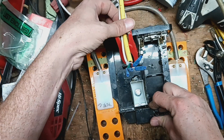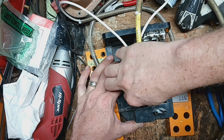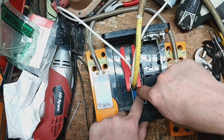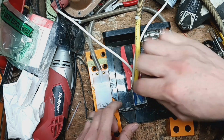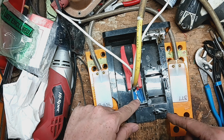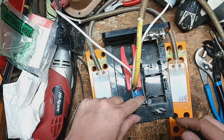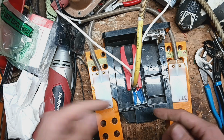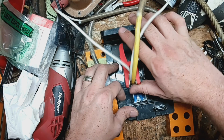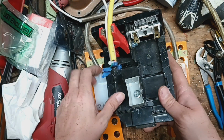And then we just take this. It's a self-leveling type of epoxy, so as we put it in, it's going to kind of work its way around all the little holes and stuff down underneath things. Put it down there flat, make sure nothing bubbles over and leaks out the top as we're pushing it in there, which it usually doesn't if you do it slow. And then walk away for a few hours, and usually once the epoxy hardens up and it's solid rock, then you can just take the clamp off, undo this, pull the whole bolt out, and then you're done.